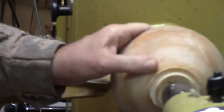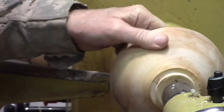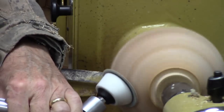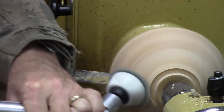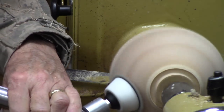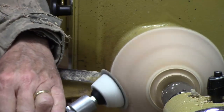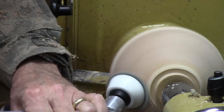That looks good. I didn't really have any tool marks to speak of. Let me go up to another grit and then I'll start texturing this thing. You've got to hold it near the lower edge so it'll move — keep it moving. I've used one of these before, but it wasn't nearly as nice as this. I got used to a powered sander, but I think a powered sander works best for the very lowest grits like 80, 100, 120. Up past 120, I think this inertia sander works real good.